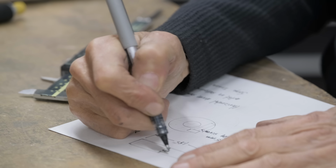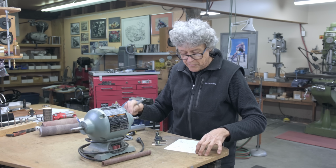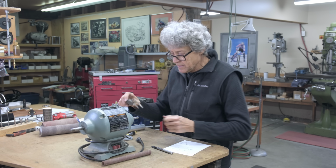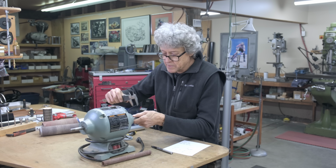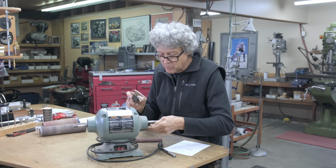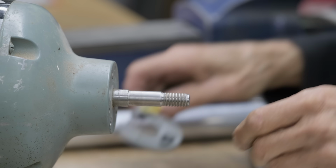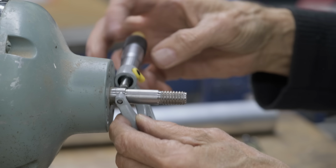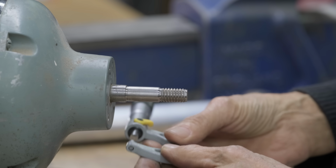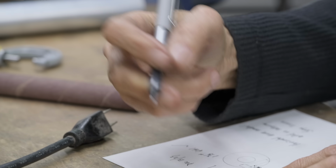Oops, 499. So it's almost 1/2 inch. I have a 1/2-inch reamer. That will work really nice for that. And we just have to do this size here, because it does have to clamp onto this as well, or I want it to clamp onto this as well. 575, we'll check with a micrometer for super accuracy. 575, right on 575.